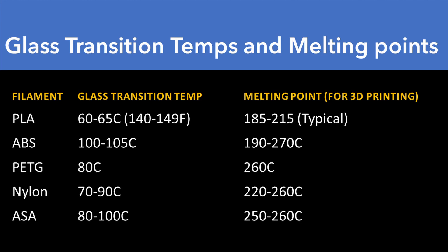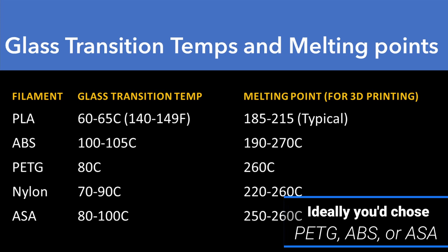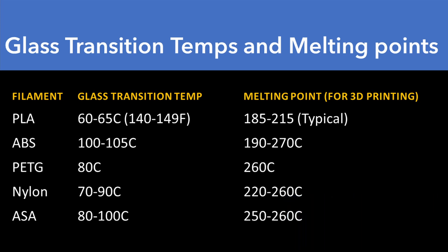When I started studying that, I learned a lot of interesting things. One of them is that a thermoplastic — which is what 3D printing filament typically is — is something where you heat it up to melt it. It has a melting zone, not just a single temperature where it suddenly melts. There's a temperature where it gets a little sticky and then a temperature where it becomes liquid. That first zone is called the glass transition temperature, and for PLA it's 60 Celsius or about 140 degrees Fahrenheit.